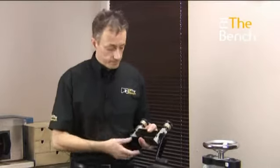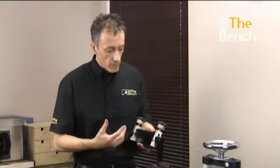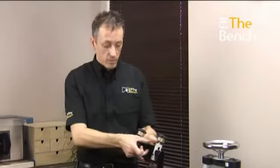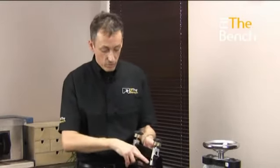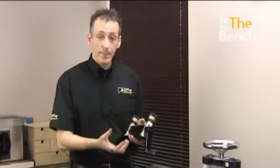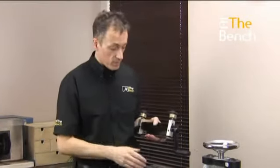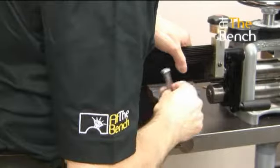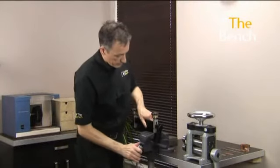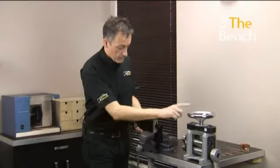There are three ways to fasten it down. There are two holes in the bottom of the plate — it can be screwed down to a worktop by removing the end block using the thumb screw, undoing the knob, sliding out the rollers, and screwing it down on the edge so the handle can turn. Alternatively, you can clamp it with G-cramps onto your work surface. In this instance, we're simply going to put it into a bench vice, away from the rolling mill so I can turn the handle.